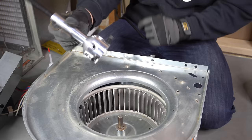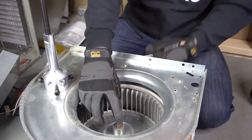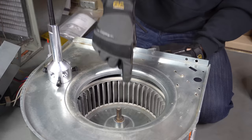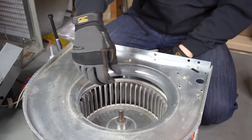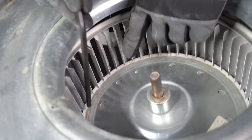In those cases I would put the hub puller on and tighten it down really hard because it kept slipping — sometimes using a big wrench for the leverage. It got to the point where those bolts actually burrowed themselves into the hub, and when I cranked it those bolts scratched their way all the way out of the hub. So instead of pushing the shaft through, they just made holes on the sides of the hub. In that case, if even a hub puller is not able to pull it out, your only real choice is to break the blower wheel apart and pull out the motor that way. I've only had to do it maybe three or four times. The easiest way is to take a flathead screwdriver or a chisel.